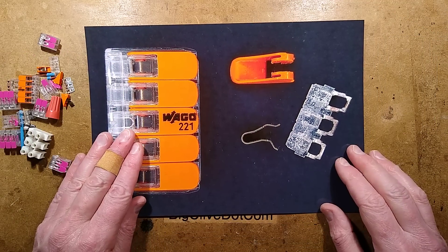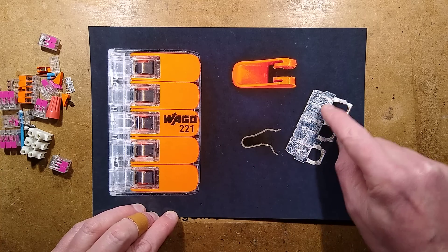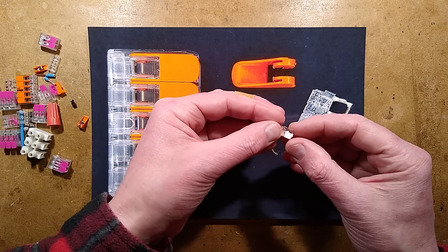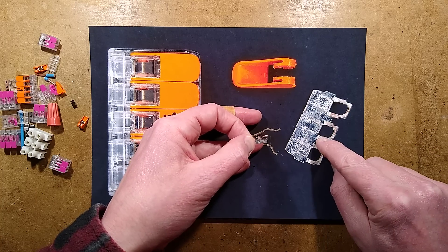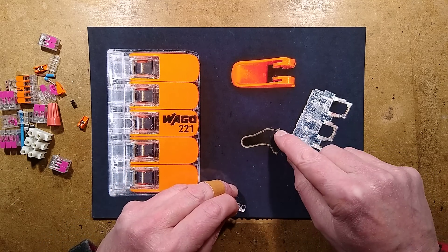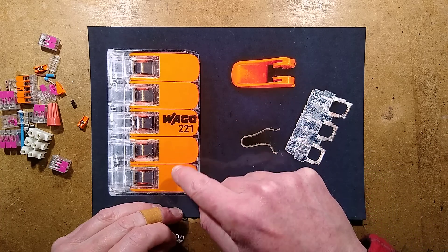Here is the WAGO terminal. This five-way WAGO terminal has five little levers — it's a commoning bus bar. That's just a three-way one. I folded these back just to show what they look like, because otherwise they'd be sticking straight up. This is a copper bus bar here — it's looking a bit scuffed because I scuffed it with a file to check if it was copper or not. It is copper. And then it's got these spring steel springs — basically one spring steel spring for each of these positions.